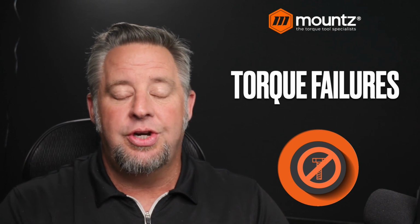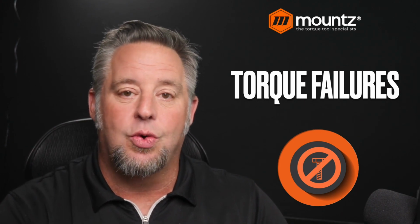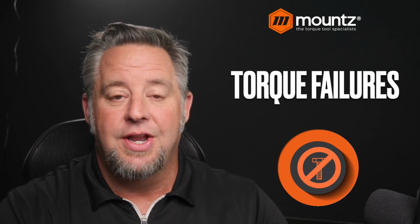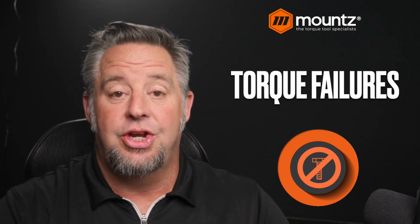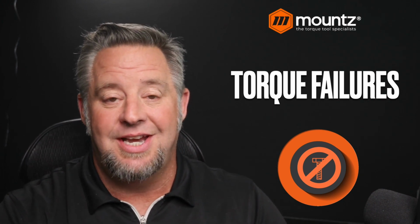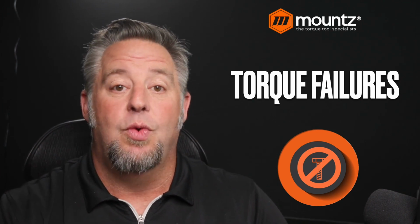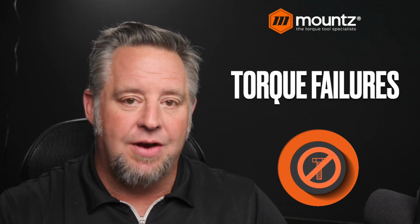If you've had the opportunity to see any of our other webinars, one thing that we typically highlight is the torque failure possibilities and how that can affect what happens with that part as it moves down the line if there is a torque failure. A single fastener can fail, and that can really cause a lot of damage throughout the process. If we can help to mitigate and monitor those types of fastening errors, such as under torquing or over torquing, both of those have the same type of failure risk, where the entire assembly can be disabled or cause, again, a lot of rework and things like that.